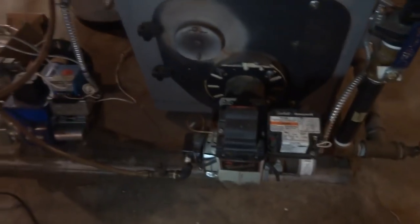This storage tank's got to be replaced, it's leaking. It's all wet. It looks like it's coming from there. The well might be loose. I'll try tightening that up. Maybe that's where the water's coming from. I'll get this thing out of here and get that one set. Get the gas pipe done for now.